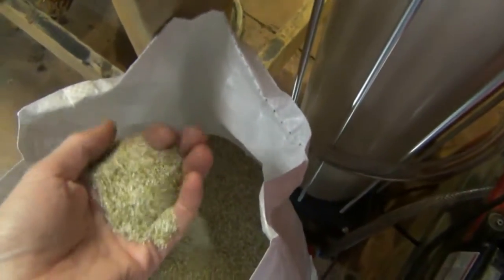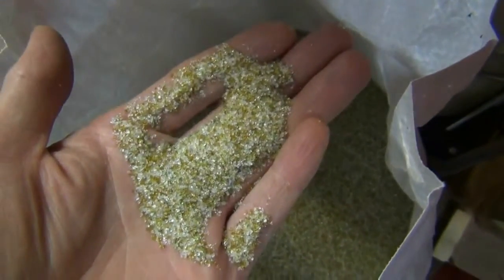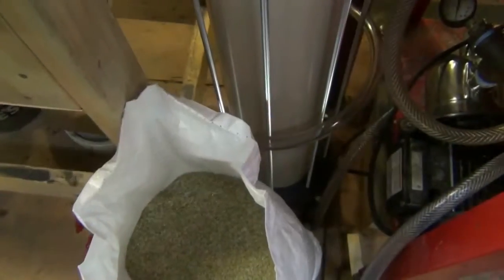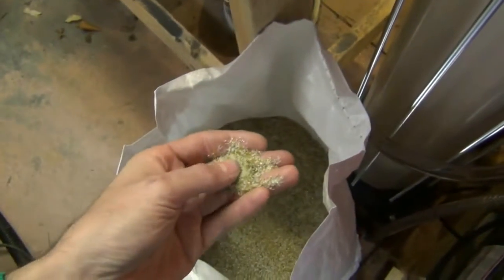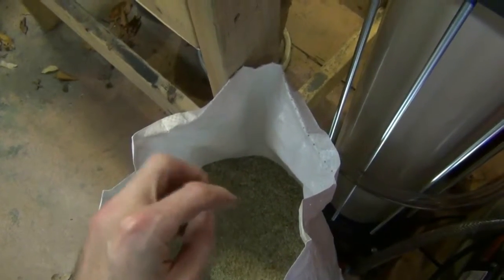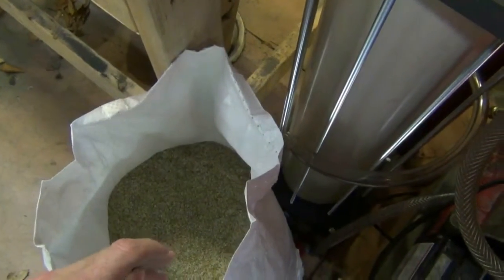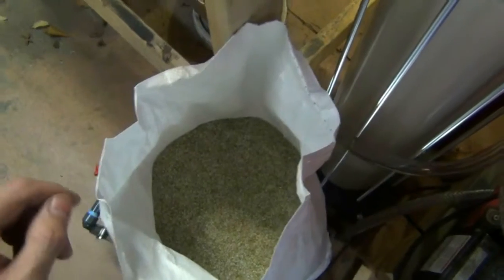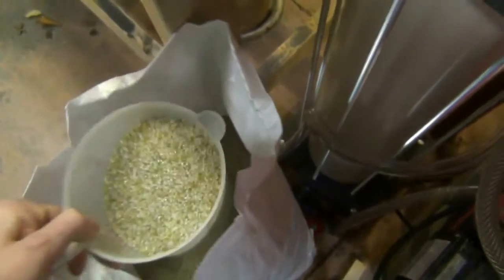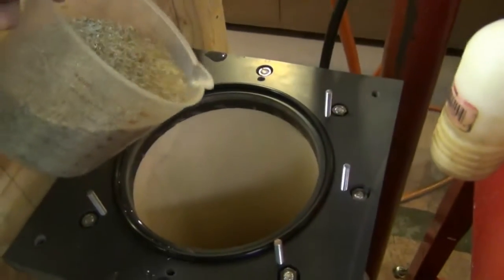this is ground up. It's actually pretty neat looking. You see it there. That's ground up recycled bottles to 20 and 30 mesh. It's pretty big. This has a slight negative charge, glass does, and it's supposed to hold on to metallic ions. So it's going to be interesting to see how well this works. So this is one of the newer things they offer for swimming pools. So I'm going to start putting it in there. I probably won't do the whole thing on camera here, but just go ahead and dump it in. You can see in there.